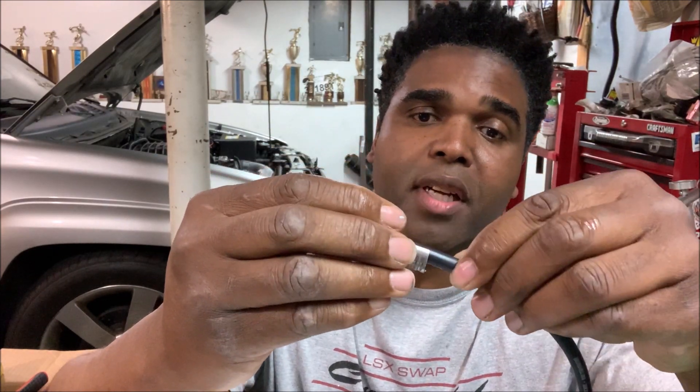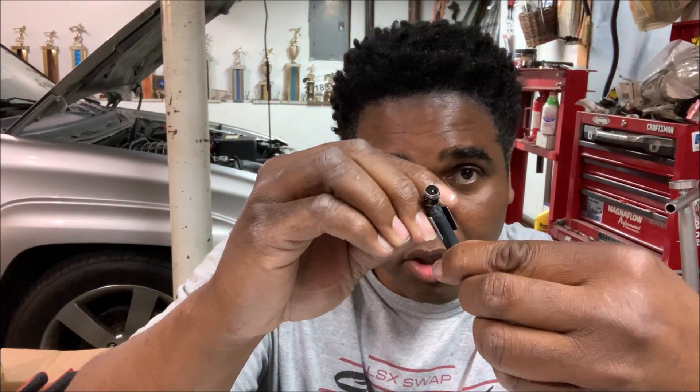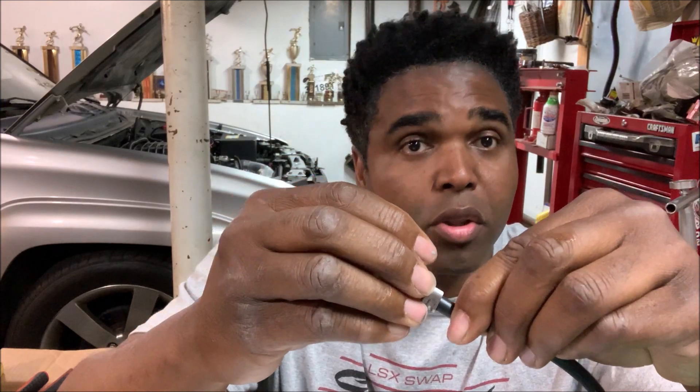With a standard crimp, take the spiral core and gently fold it back like that — you want the spiral core to be on the back side of the terminal, just like this. You don't want it hanging out the back. Now you can use a razor to cut it, but you don't want to risk cutting that spiral core. Instead, get the ratchet clip, put your wire in there, spin it a couple times until the ratchet stops, and you get a nice clean cut.